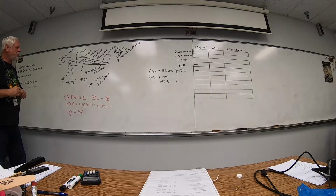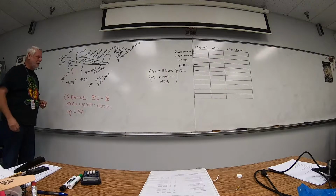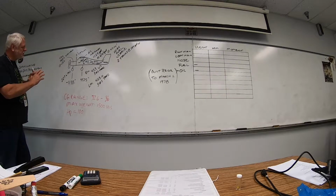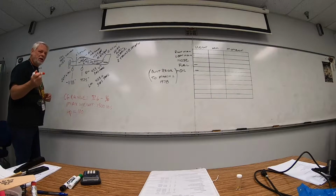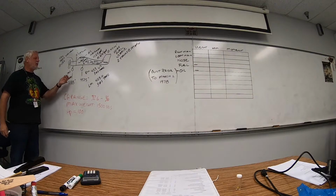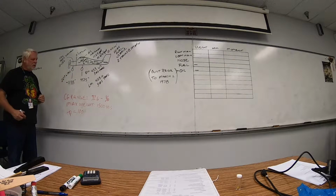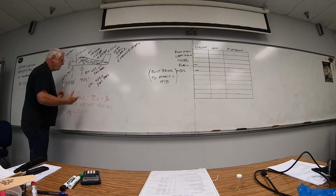So anyway, I put some numbers down here. These actually came from our Cessna 150A. I know it's kind of a hodgepodge of stuff, but hopefully with the video you can figure out what we're talking about. So first off, you go to your type certificate data sheet and find where the datum is going to be. You find where the seats are going to be. This is all from your type certificate data sheet.